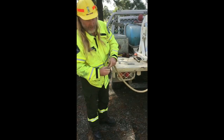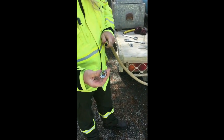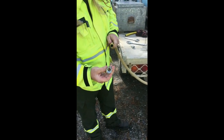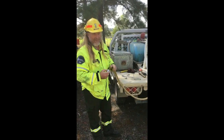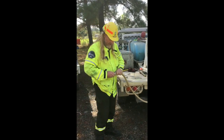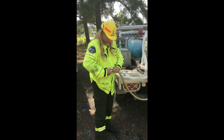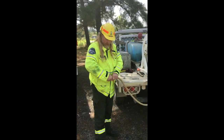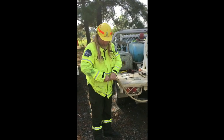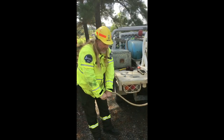Now this has got a really coarse thread in here, and that's what the hose is going to go into. It's a left-handed thread. So for those Kiwis out there, that doesn't mean you use your left hand to put it on — it means you've got to turn it the other way. If you have trouble putting this in, because some of these hoses get a bit tough, you can put a little bit of lubricant on it if you want.